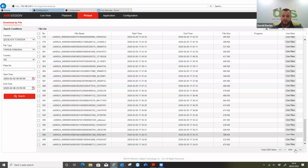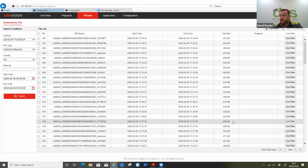When setting up, is it best to put the required settings and whitelist in the camera or the recorder? If you're doing it, either is the answer. So if you've got an iSeries NVR, you can do it through the iSeries NVR. What I would say is, if you're using a compatible NVR or DVR, I would do it from the DVR NVR itself and do the trigger action from there. There can be conflict if you put the list on the camera, but the trigger action comes from the DVR NVR. So it's one or the other, not a bit of both, but we would always recommend from the NVR DVR primarily, unless the camera is in isolation, which it can be. Hope that answers some questions.